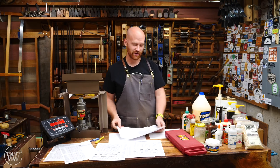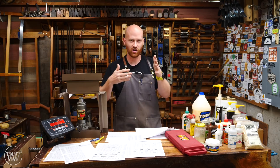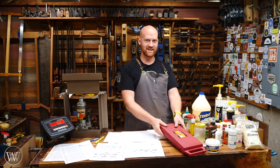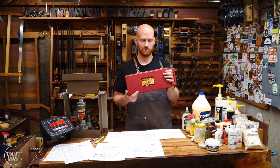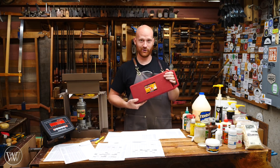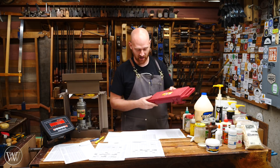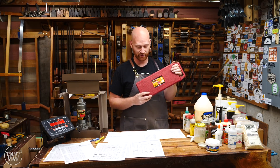Let's jump into long grain to end grain — this is where it gets interesting. I did not expect most glues to do any significant strength at all with long grain directly to end grain. And this is where things get really interesting, because the number one answer was 2P10 gel — a cyanoacrylate, number one on long grain to end grain. Closely behind that we have the epoxies and the PVAs, but the 2P10 numbers were right at the top doing phenomenal work.